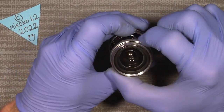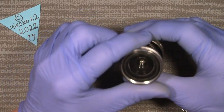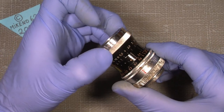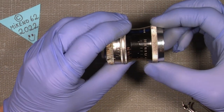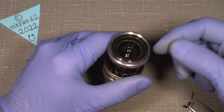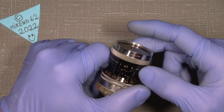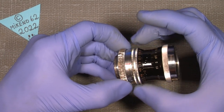That will be the next video about this. In this video, I would like to try to clean whatever is in the blades, the actual focusing ring behind here, where you can see the small dots in the depth of field scale. And how to get into it? Well, it's almost the same as going into the front lens groups: the front lens group, the next lens group, and then the aperture assembly, and then you take off the aperture ring.